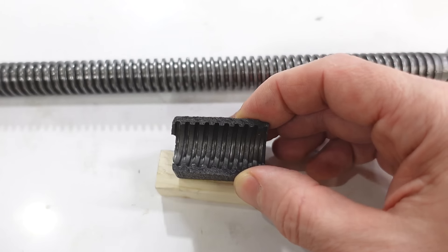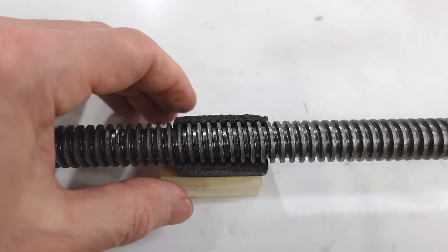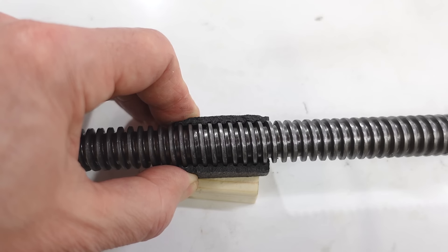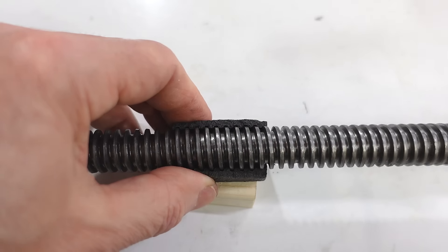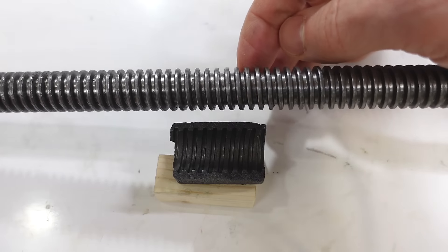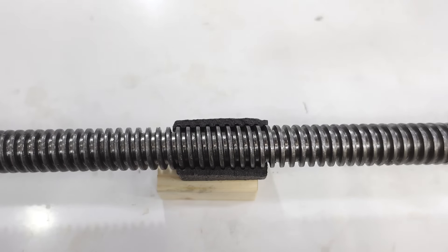Here's half of a lead screw nut, and the lead screw has an awful lot of play in there because the whole thing is rather imprecise. If there's a lot of friction on there, that means the lead screw is always kind of pulling in one direction, and that eliminates a lot of the play. Whereas without that extra pull, as I'm pulling it, it might either pull itself center or kind of drop down towards the bottom of the trapezoids. And with these threads being trapezoids, if it's centered versus on the side, that changes how far over it will pull — and that was causing my inconsistency.